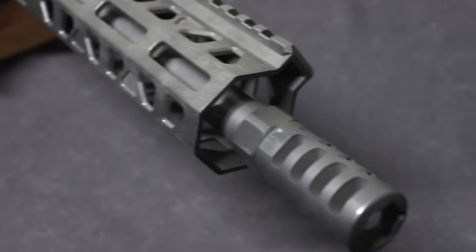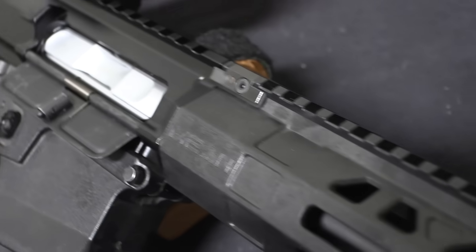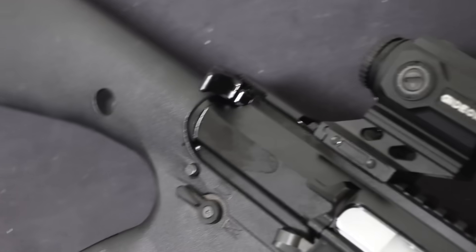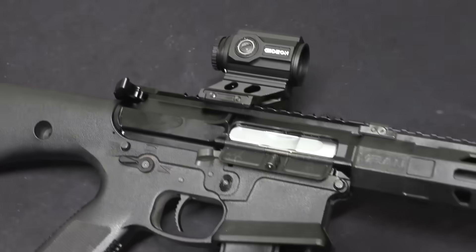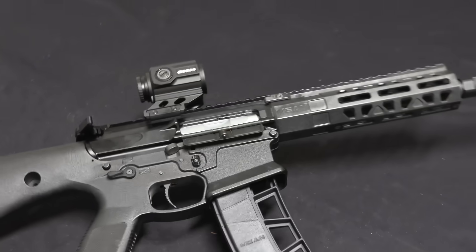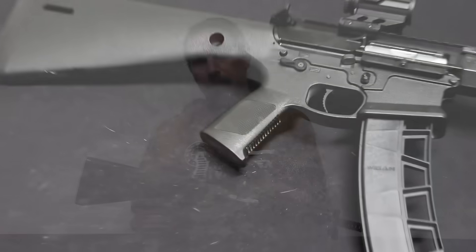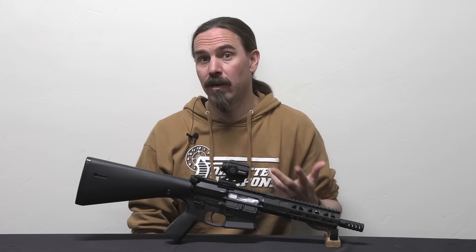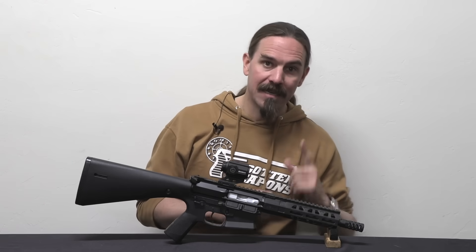There are two major categories of 9mm ARs. There are the simple blowback ones, and there are the various delaying mechanisms. A simple blowback AR9 is very simple — it's just a bolt that's heavy enough to work in simple blowback. These tend to have relatively high recoil compared to the delayed action systems, because that bolt is just slamming into the back of the receiver with every shot. They're going to have more muzzle jump and more perceived recoil than you might expect from a 9mm carbine. And that's where all of the delayed systems come in.